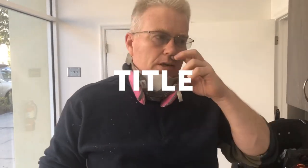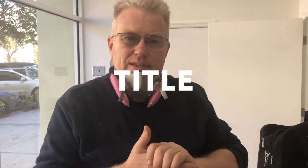So we're doing a mural today and we're prepping our tools. One of the things that we do when we prep our tools is to make sure that the smoothers that get nicked, scratched, are now sanded off, just to make sure that we don't scratch the wallpaper with the scratched tool.